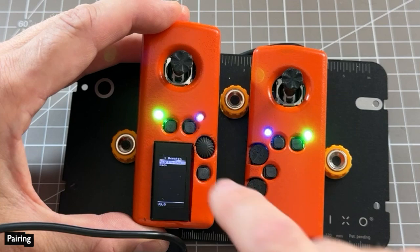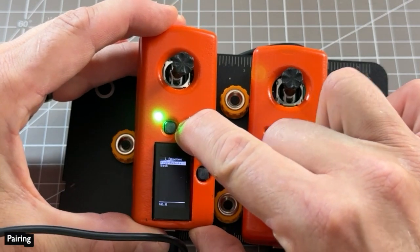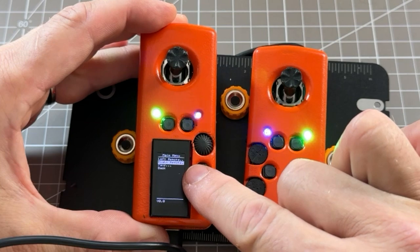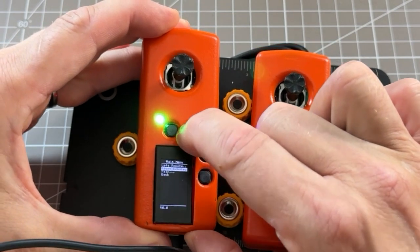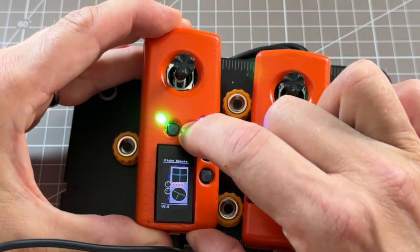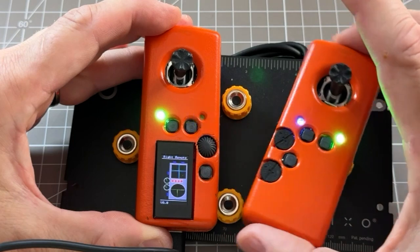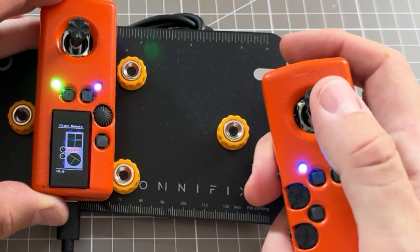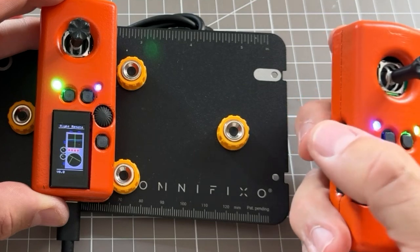Pairing information is of course stored in Flash, and upcoming software versions will allow loading and storing multiple configurations of droids and remotes. As we've paired with the right remote now, you can see an entry to access its settings in the menu system, and as we go back to the main screen, we see the visualization for the right remote just like we saw for the left one earlier.